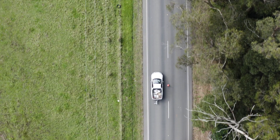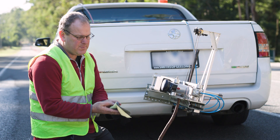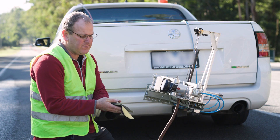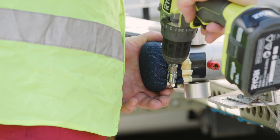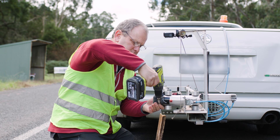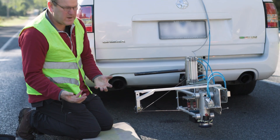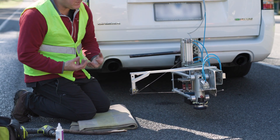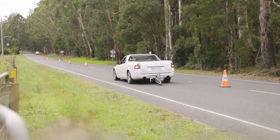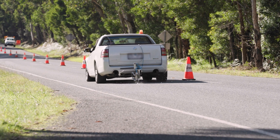The next part is to take our test sample. We have a piece of denim, a piece of Kevlar, and a piece of comfort mesh. These are put onto the test head, and our test head simulates an elbow or a shoulder. Now our test machine is ready to test. The sample will be lowered to 50mm above the ground, and then as we're driving along the road, it will be dropped down onto the ground and we'll measure how long it takes to form a hole.